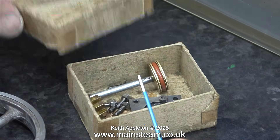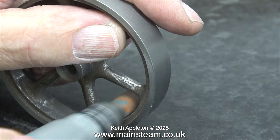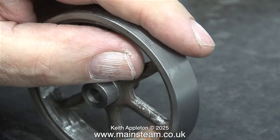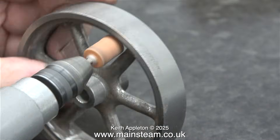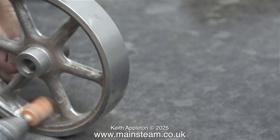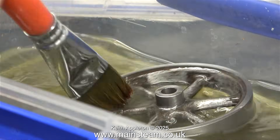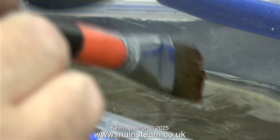I've removed the grub screw from the flywheel because I'm going to do some more work on it. I cleaned it up with a needle file and a grinder and all sorts of things, but it still wasn't how I wanted it to be, so here I'm using a fine grinder and going over all the parts again. You can see where I'm having to remove the casting sprue, not just from the edges of the spokes but from all the way around the edge. This took a while, but finally it was looking a lot better, and the next part of the job is to put it back into the cellulose thinners, just to remove all the particles of cast iron from the grinding process.